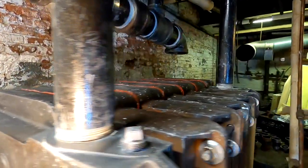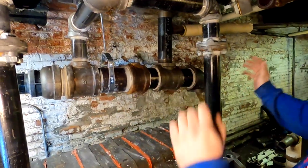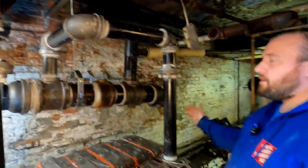So I drop it, losing as much water as I can, right on the risers, then whatever else I can, right in the drop header. I go larger to try to slow that velocity down of that steam. I don't want it so aggressive. I don't want water in my steam lines. This is why I go a little above and beyond. But hey, every time I've done it, it's always worked for me. This is what I do.